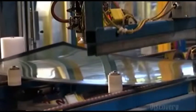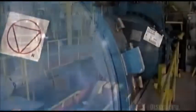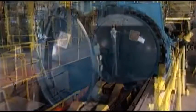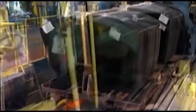Now, squaring pucks position the windshield, and a robot sticks brackets for the rear-view mirror onto it. This big blue chamber is an autoclave — it's like a pressure cooker. After about an hour in there, any remaining air pockets in the windshield are removed.